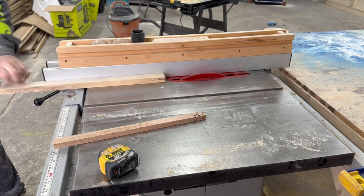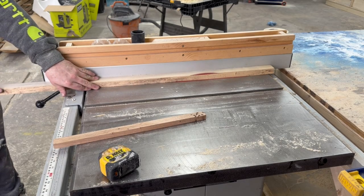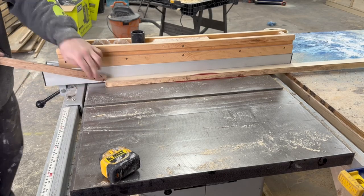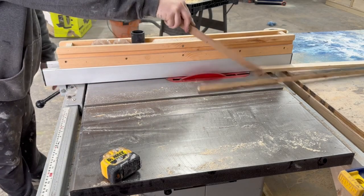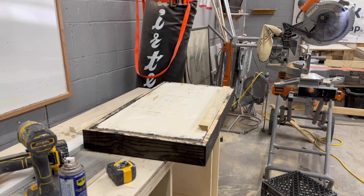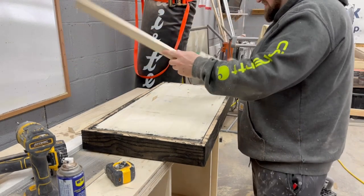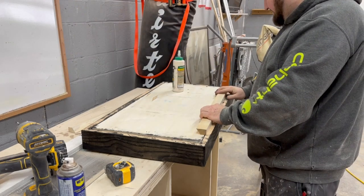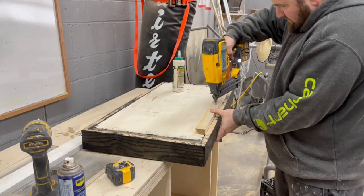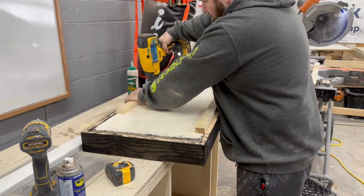With a scrap piece of wood I'm going to cut what's called a French cleat — it's just two angled boards that hook into each other. I'm cutting one strip in half so I have two pieces that connect together at the exact same angle. This gets glued and nailed, then I'll add some screws to really secure it to the backer board. I'm also adding a little piece at the bottom to space it off the wall properly so it's not sitting on an angle.